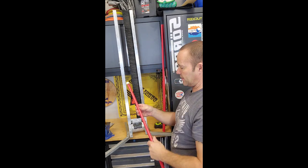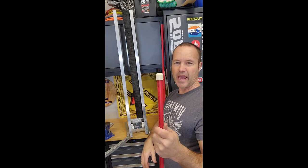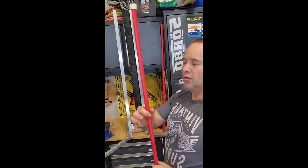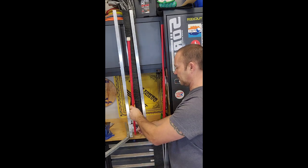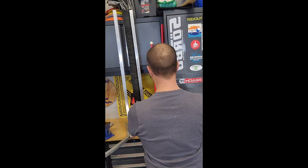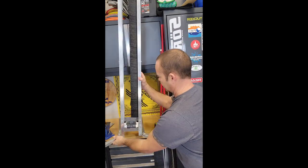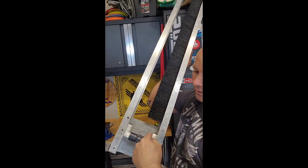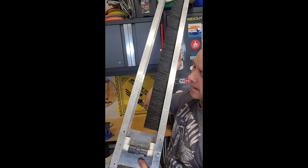For my upright tubes, I went with just half-inch tubing with a cap on the end — the water shoots out the top basically. For the fittings, you can get them as SharkBite or other press-on type fittings. Those fittings are nice because you don't need to solder or thread anything — they're push-fit fittings. You can see there are two of them: one push-fit, another push-fit. That red upright tube just sets inside and runs upright.